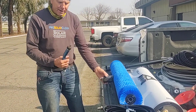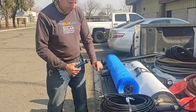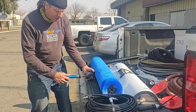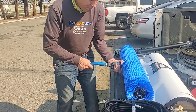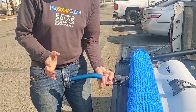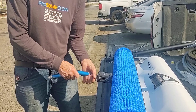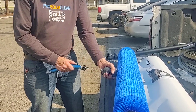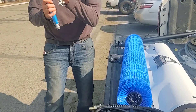When installing the gooseneck, note that different materials are used — some alloy and brass — and the brass can eat the thread if you don't pay attention. Put the hexagon exactly in place, use the 22-millimeter knob, push it in, and go all the way to the end. Inside we have two sets of washers and O-rings which perfectly seal the connection between the gooseneck and the jet — you have to overcome the resistance of those rubber O-rings to seat it properly.